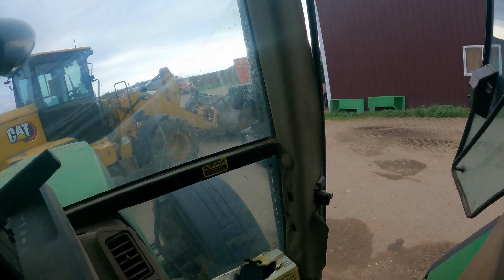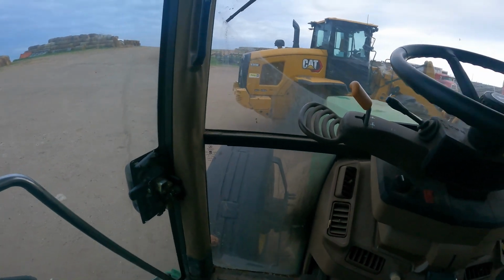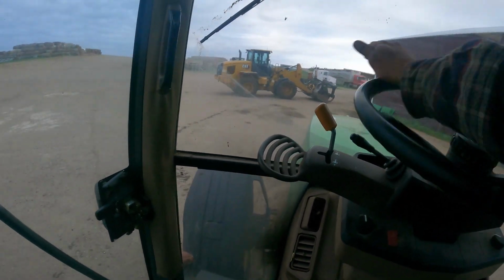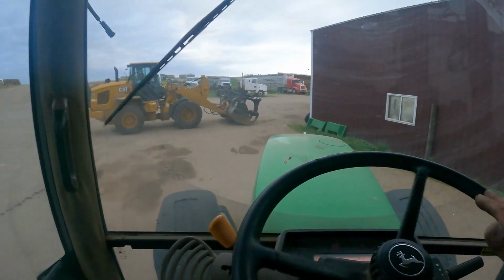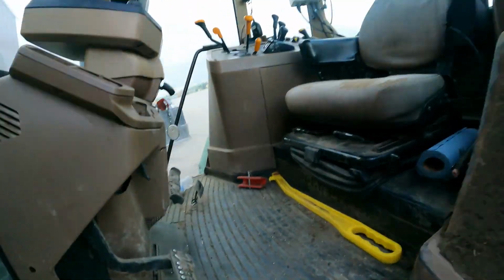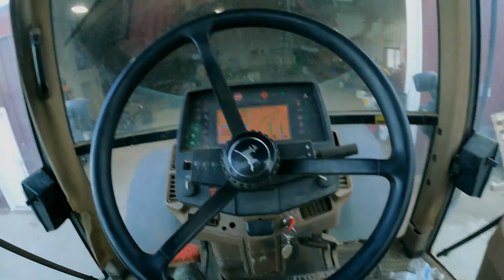Oh yeah. I gotta wash the radiator out before dirt again. And it's windy. Payloader. So I'm just gonna pressure wash out that radiator because usually I blow it out with the air hose, but that just doesn't do it because it gets packed in there. So pressure wash it out.